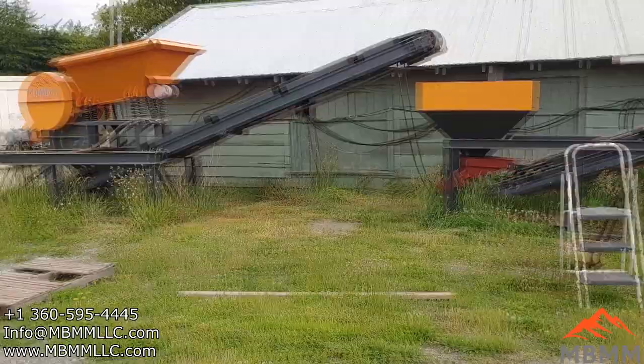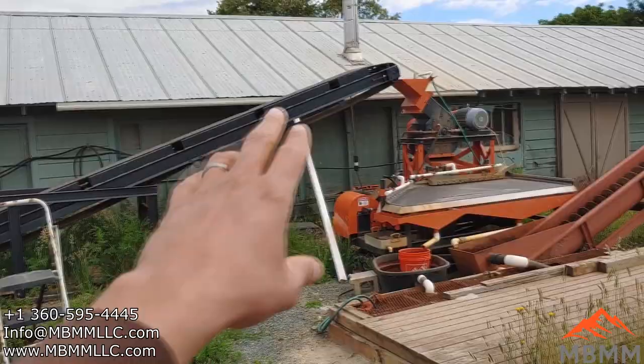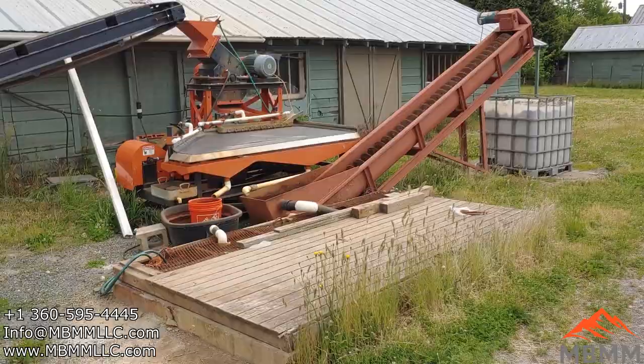The fine stuff that comes out of the first spiral and the second spiral would go into a flotation cell, and you could recover any fine sulfides or free gold that was lost because of gravity recovery. You could make a secondary concentrate out of your 200 mesh minus material and increase your recovery quite a bit over just a gravity circuit. Right now this system is great for initial testing and recovery — jaw crusher, vibrating feeder, hammer mill, primary shaker table, and a tailings management system. It works really well for sampling, processing, bulk sampling, and flotation and regrinding would be a good way to improve it.